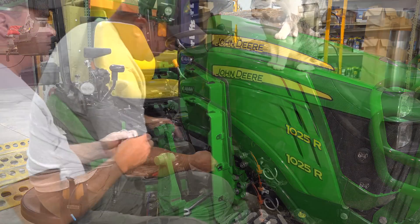These caps on the inside of the quick couplers are hard to get out — the internal ones. The external ones aren't so bad, but I'm getting on to it. Nice though, it keeps the dirt from getting in there. Some folks might ask about using Teflon tape or other pipe sealant — well, you don't have to when you've got the O-ring. Any type of O-ring seal, either the ORFS or O-ring Boss, you don't have to use any sort of sealant to prevent leaking. The O-ring itself does that.